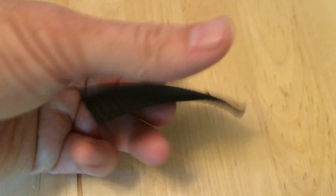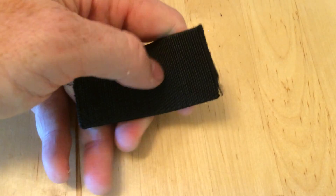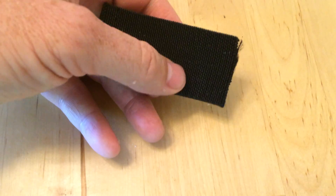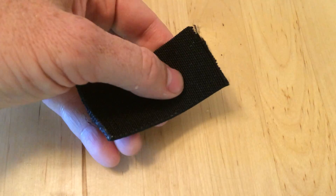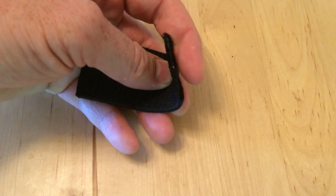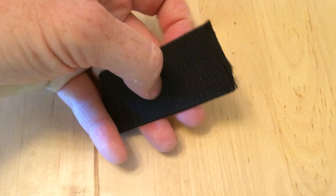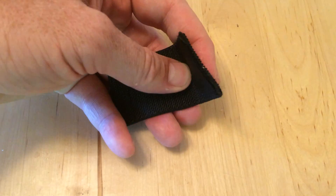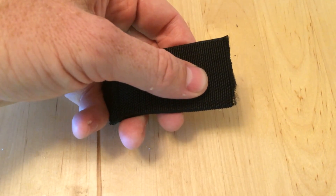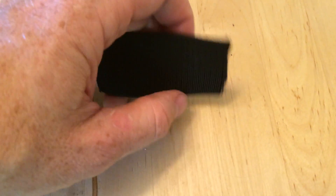These belts are made out of synthetic plastic-type material that you can burn with fire, but some of them are made out of more of a cotton-type material that will just burn. So you probably want to take the piece that you cut off and test it by burning it. If it melts down to a nice shiny edge, then you're good. But if it just catches on fire, then rather than burning the end to seal it, you'll want to use some superglue — just run a bead of superglue down it, and that will stop it from unraveling.